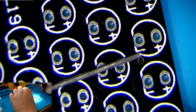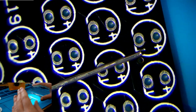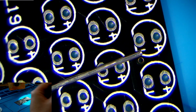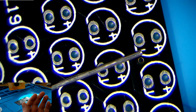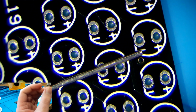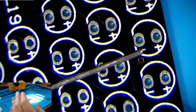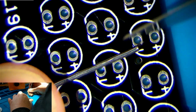So, as just mentioned, solders have flux within them. Flux is incredibly important to the soldering process. This is Kester No Clean, which will contain a no clean flux. Some solder wires contain rosin flux. And rosin is slightly corrosive. If you leave that on a board, it can potentially cause corrosion damage, so it's always smart to clean it up. But in this case, what we have here is a piece of Kester No Clean.